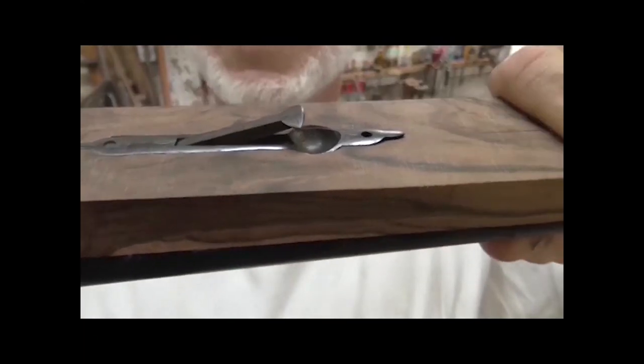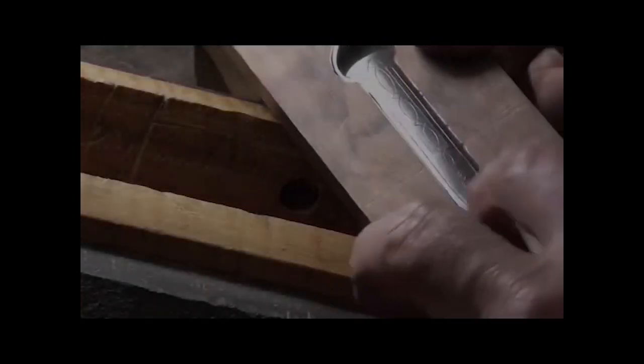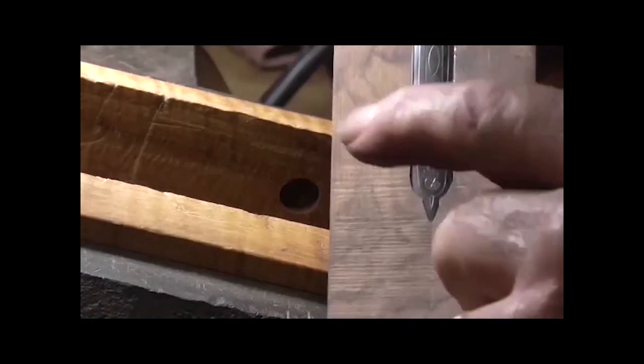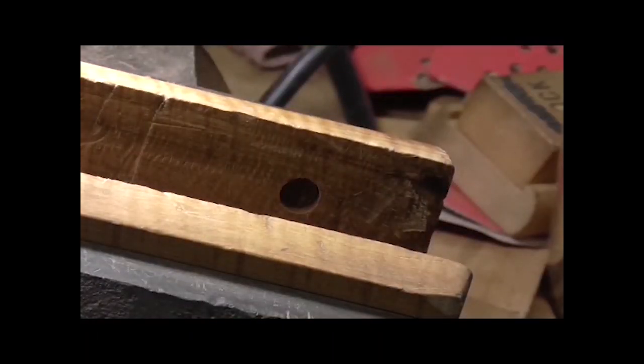Alright, I pushed it on there, and it pushed that lever up. That lever is spring loaded. When I push this down, that lever goes up, which means it's not quite close enough for that lever to go ahead and snap down, which means I'm on the right track. That is almost like a quarter of a turn from being up there. It probably worked like it is, but it depends on how this mechanism works. More than anything, it depends on how it catches. And I may not be able to tell how it catches without putting the barrels on the receiver, maybe.